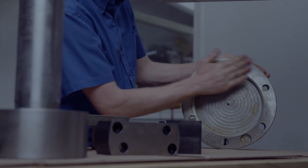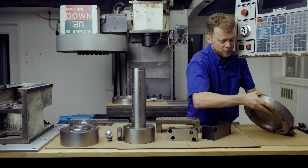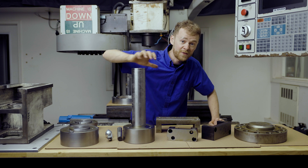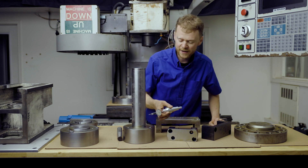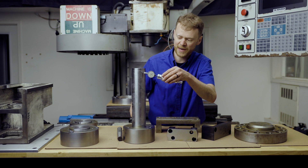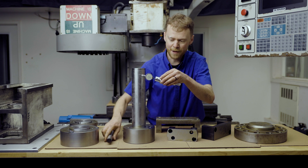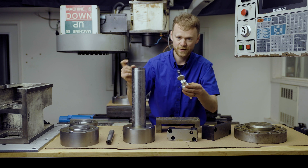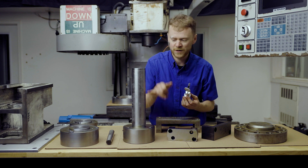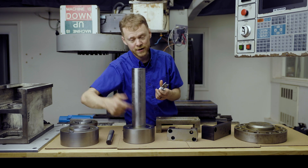This is what the back of your spindle nose would look like — it would be clean, but all of these are dirty because they have cosmoline on them. Just touching them will surface rust them. So, a test bar you bolt to the spindle, and you dial in the runout at the base, and then you dial in the runout at the end. I don't want to see any movement on my indicator right here when I spin this test bar. Then I come out to the end and tighten or loosen these three bolts to dial the end in. So now I know it's running true here and it's running true here — and when I mean true, I mean two tenths or less. I dialed in one of these bars the other day and got it to about 50 millionths here and 70 millionths there.